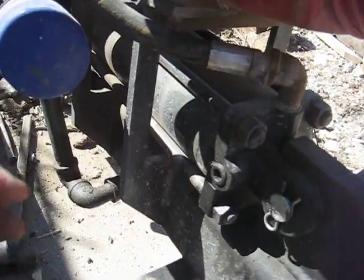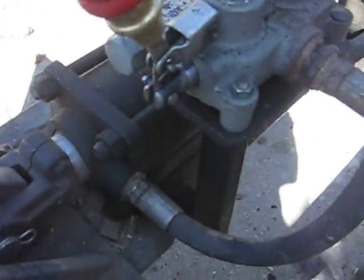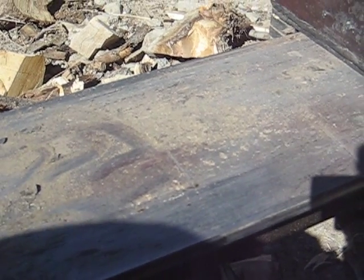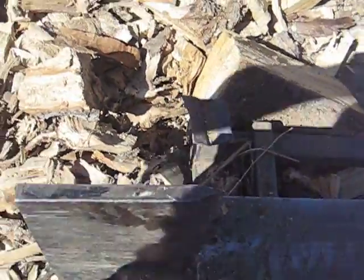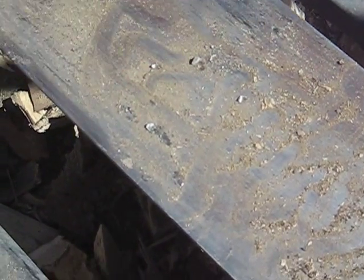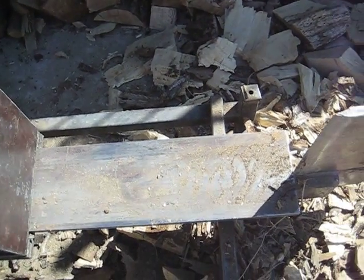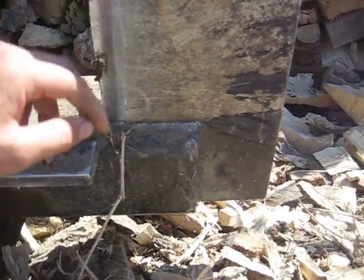This line here comes over to the other end of the ram, and then this other one comes to the front of the ram, which is the return side. I basically took a half-inch plate — there's a guide plate here the logs also sit on. I put a lot of thought into this: it's eight inches wide, and the wedge is 12 inches tall. The reason I did that is so if my log is wider than this plank, I know it won't fit in the fireplace one way; and if it's longer than the gap between the wedge, it won't fit in my fireplace either. I welded the wedge onto the end.